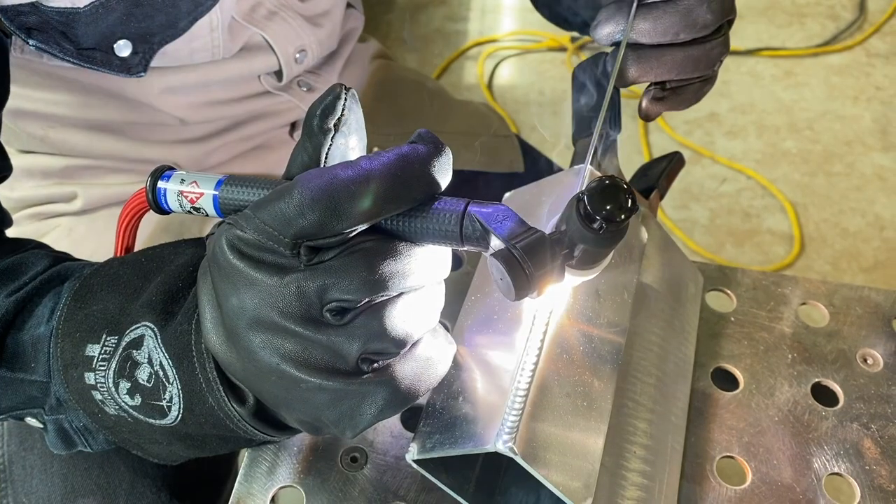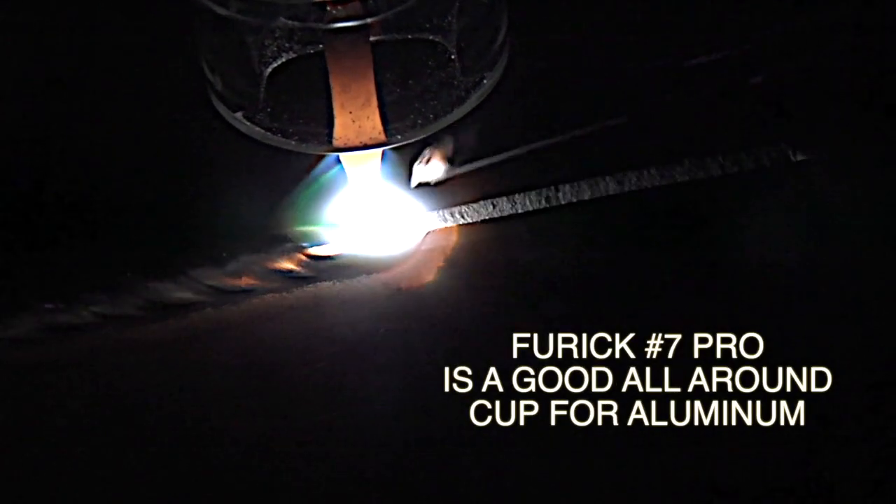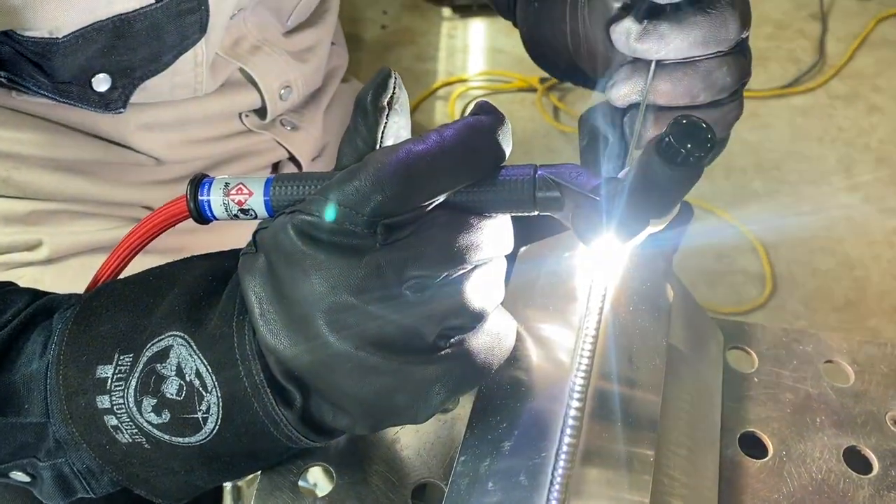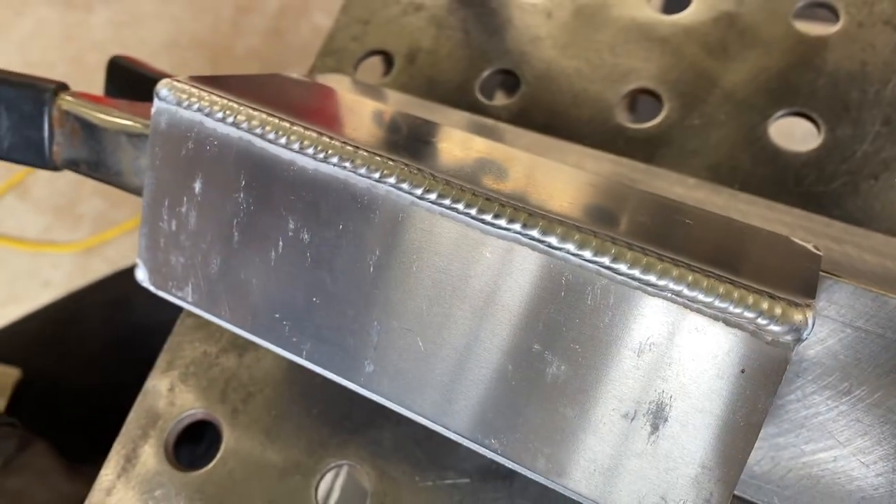There are applications on new metal where a simple wipe with acetone is good enough. In a recent video, my friend Andrew Carden was welding some outside corner joints on some brand new aluminum that I had ordered. A simple wipe down — I think we just used a dry cloth on this. Acetone certainly wouldn't have hurt anything, but it sure did come out nice and clean anyway.